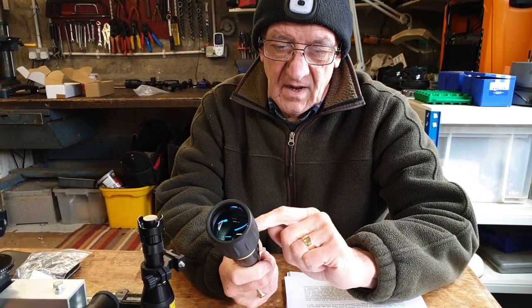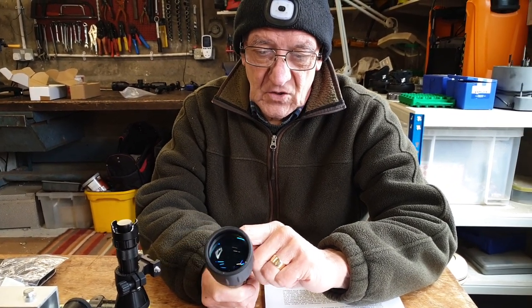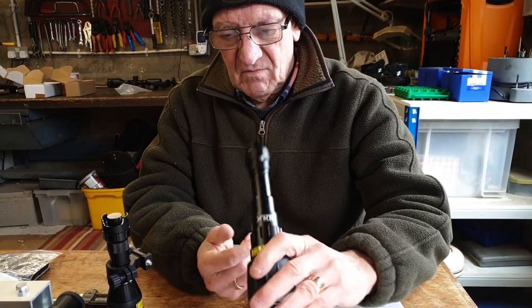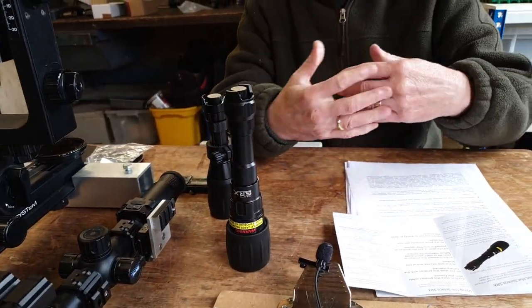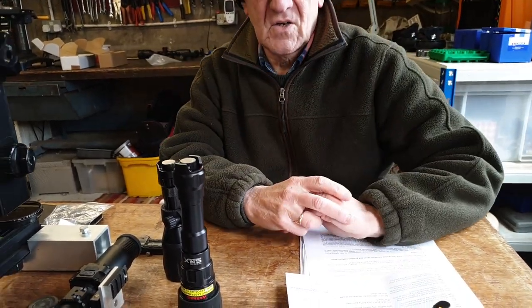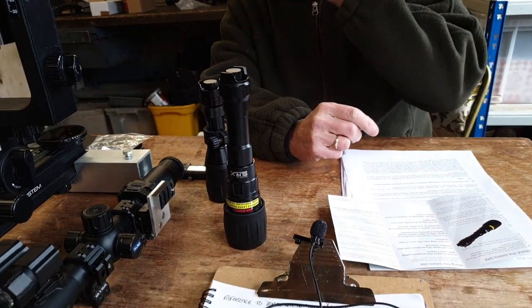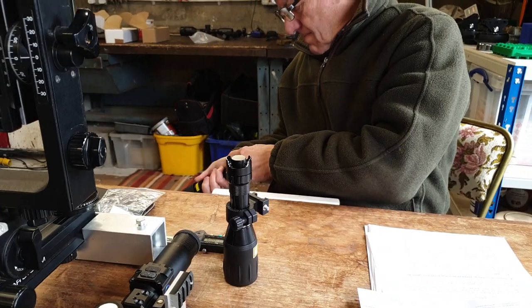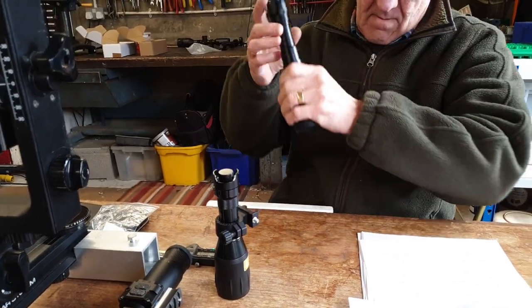Whereas the warning, invisible laser radiation, avoid exposure to beam, relates more to the laser standard. So you've got to put on warning labels that cover both of the different standards. And the bottom line is, you don't ever look into the beam. Could you switch one of these on, Bruce, and just shine it on the desk? So if in doubt, you look through a mobile phone.